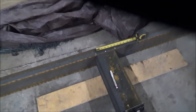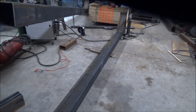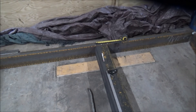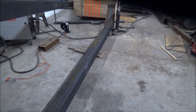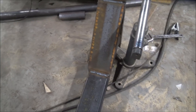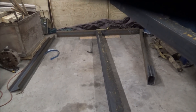I have gotten the beam laid out square and centered, ready to weld this up — even got it turned the right direction, so that's a big bonus. Got that piece of plywood under it to space it off so I've got the same amount of gap on both sides to center it up. That end down there is held up a little bit because of the spacing on top so you can get to the bolts on the end. We've gotten them all welded out — looking pretty good. I'll get the welder fired up and see about getting this base tacked on.